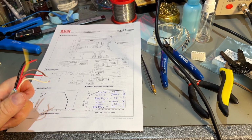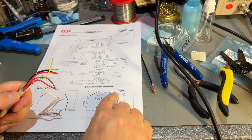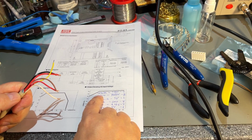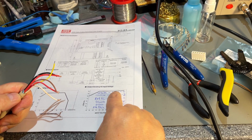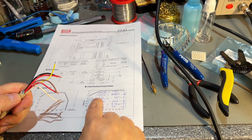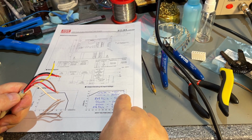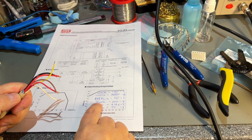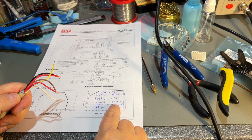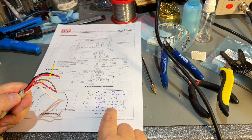So I measured out all the wires with the multimeter, and the white one is the -12 volts, pin 5. The casing and pin 2 is yellow. The thick red is as expected 5 volts plus, pin 1. The black is as expected ground, pin 4. The brown is the plus 12 volts. And the thin red is actually connected to the thick red, and also 5 volts.